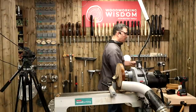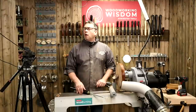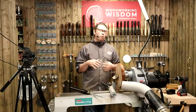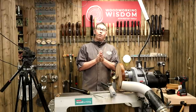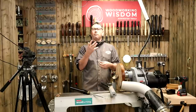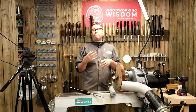And then a question from Vida. He says, it might be a strange question, but what does food safe oil really do? Does it make the wood itself food safe, or is there any other preventatives in the oil itself? No. So all a food safe oil is, it's like a mineral oil. It's an inert substance. So it's a non-toxic oil. The difference between that and a toy safe oil is that a toy safe oil has a drying agent in it. And basically it'd be toy safe once dry. So once those driers have evaporated out, then it's safe to be mouthed. Where a food safe oil is non-toxic in its wet form.